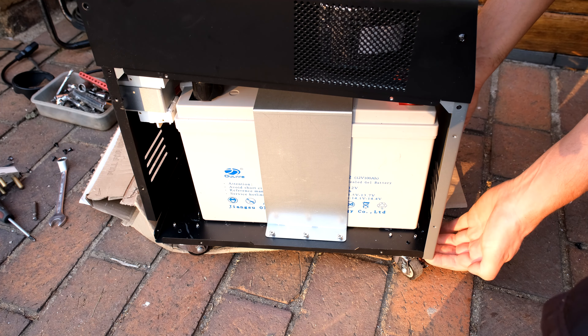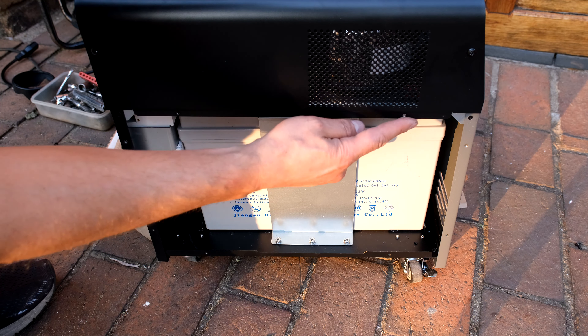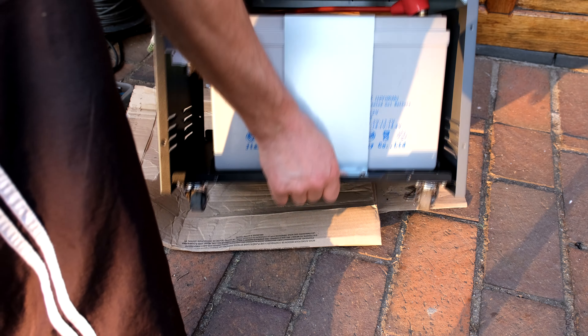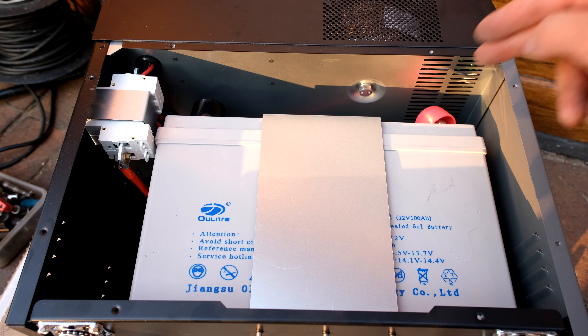The front panel goes over it and the back also goes over. Now flip this on its side — be very careful to make sure that the battery terminals are covered by the back panel and cannot short on the chassis. Never let the positive and negative terminals touch the top of the unit or the battery will be shorted out and damaged.